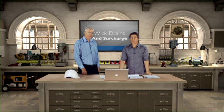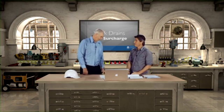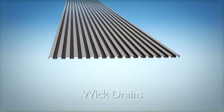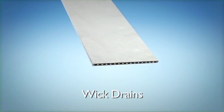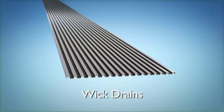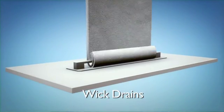In the story of soft soil treatments, the chapter on wick drains and surcharge is a riveting one. Wick drains are basically like a sock that we drive into the ground that have a geofabric on the outside to filter the soil, and then a core of plastic with tubes on it to allow the water to come out. So it's like a candle — you put this big wick down into the ground, except instead of lighting it, it's actually drawing the moisture out of the soil.